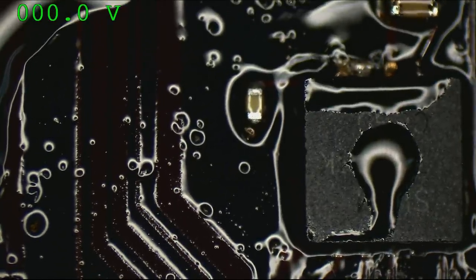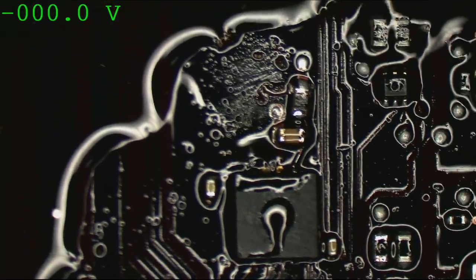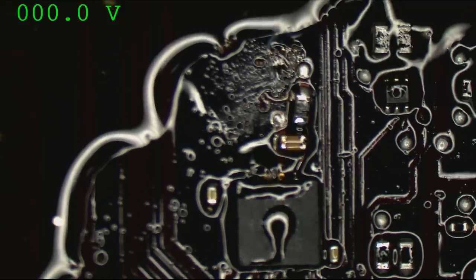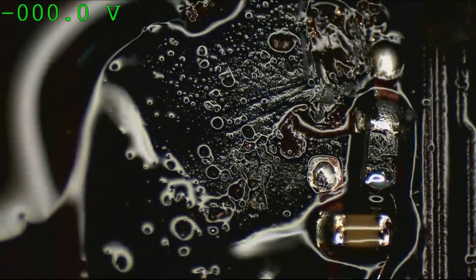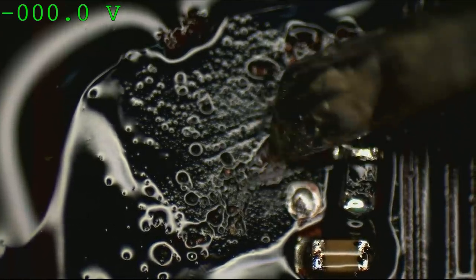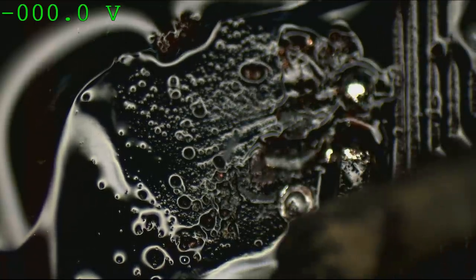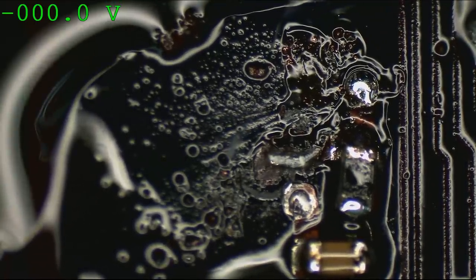You're a broken trace. So this has to connect to this pin down here. And this trace looks awfully questionable. Yeah, look, this doesn't go anywhere. This is all broken. All right, so let's run a wire. A little jumper wire.